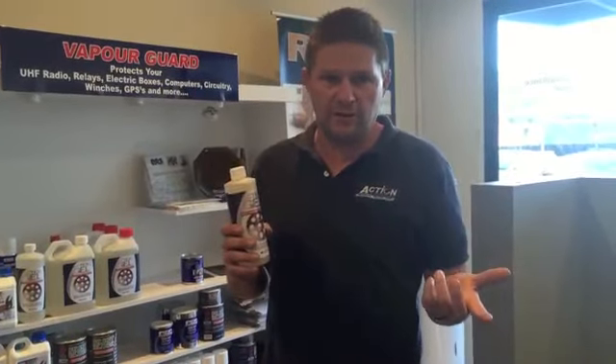The key to a successful metal restoration project is rust removal, rather than relying totally on rust conversion. The problems associated with relying on just a rust converter is that if you put too much of the product on, it leaves an acidic surface. If you don't put enough on, it doesn't go through the layers of rust and convert all the rust, which means later on rust can pop through a coating that you put over the top. It's for this reason that products that are purely converters are not permitted in some areas of steel construction.